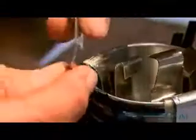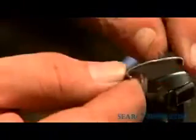So we're going to bend a C like before, only we're going to go over the edge of this cup. The insulator, which is now zip ties, will protect us against electrical shorting out on the cups. So we measure twice, we cut once, and we bend as many times as necessary to get this right. This clamp needs to be on here very firmly. It took me quite a bit of time to actually work this piece in, so there's a little bit of editing going on here to make this done in a reasonable amount of time. So here's the C that we actually snap onto the fuel cell.